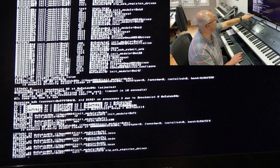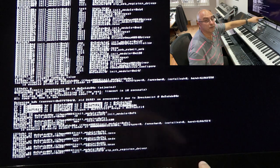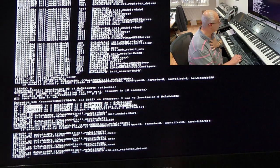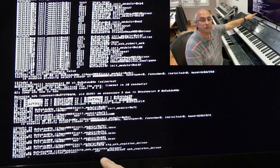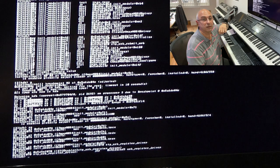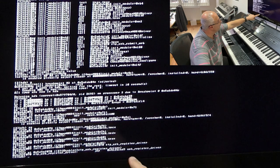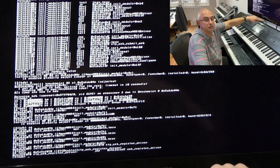So now we'll trace, and I'm now going into this call of STG USB register driver. Notice the function name, STG USB register driver. And if I go inside it, here is what it does. It just says, I don't care, just go straight to the original OS USB register driver. Which tells you one thing, that this whole STG stuff is not needed. It's just to slow things down. I mean, why would you do that? So USB register driver is actually the right function when you call STG USB register driver.